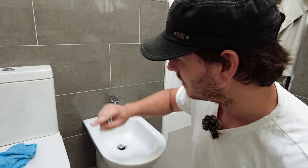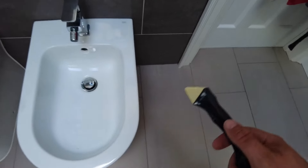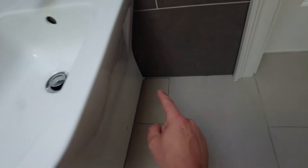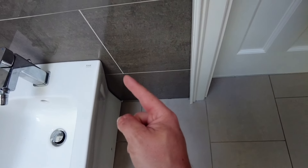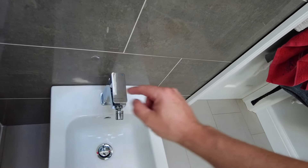I started with a 6R, wasn't particularly happy with it, then changed to a 10R — ten millimeter radius. Before we go back upstairs, I'm going to show you downstairs quickly because there was something I didn't explain properly. For this one it's going to be easier because I've got tiles and it's both smooth. Upstairs the floor's rough so I'm going to go 6R again because it's tight. What I do silicone-wise: I do that bit first, then silicone that — tool it, silicone that, tool it, silicone that, tool it.